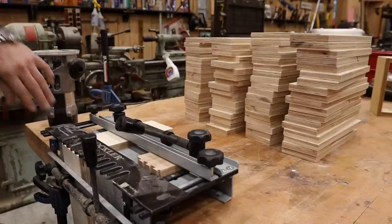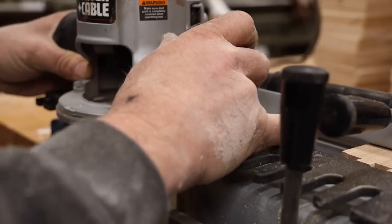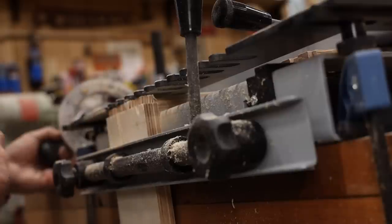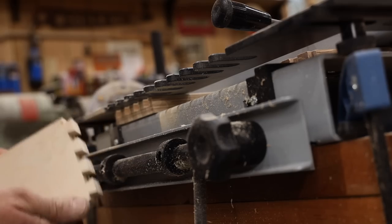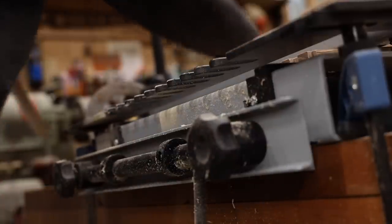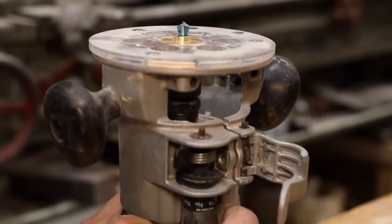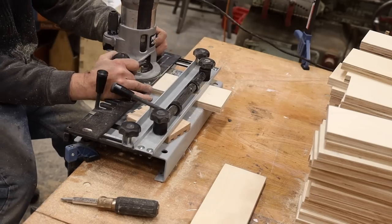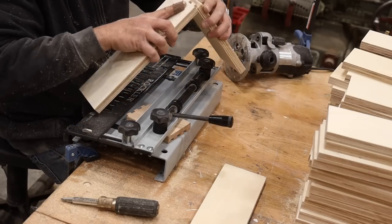When you do these blind dovetails, you cut both sides of the joint at the same time. Everything comes in the kit — the flush cut collar, that brass collar — and it fits most routers; it fit my Porter-Cable no problem. When you get this, it's really important to do some test cuts. It takes a few minutes to get your mind wrapped around exactly what has to happen. Here I had to adjust my cut — with dovetails, tightening or loosening depends on which way you lower the height of the cutting head, giving you a looser or tighter tenon.